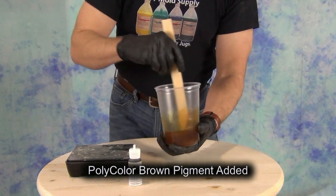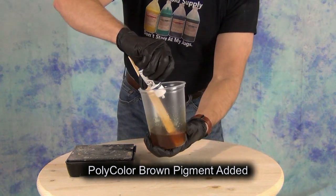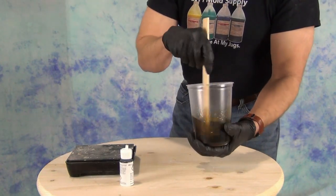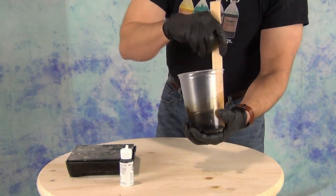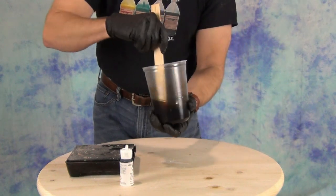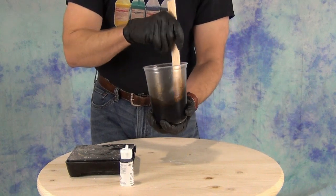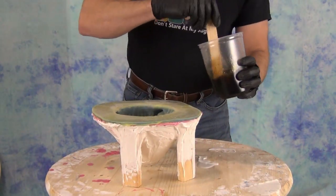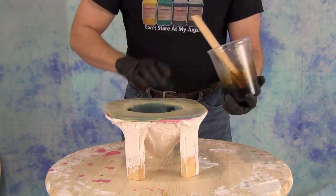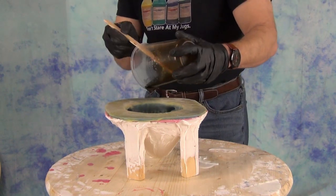I usually like to start with about a quarter of the volume of the mold or less, and you can always adjust that later on. It's really important to take notes and write those amounts on the outside of the mold, so anyone doing production can look at it and see exactly what it takes — for example, the resin surface takes 200 grams and the foam backing requires 400 grams. Keeping track of that is essential so you can have uniform, consistent parts in production.